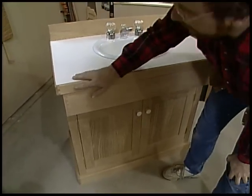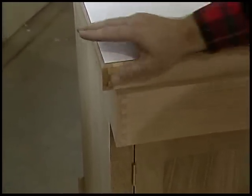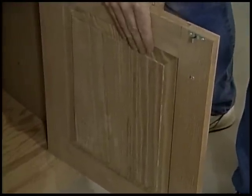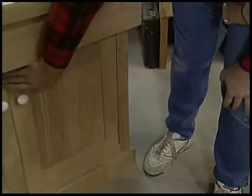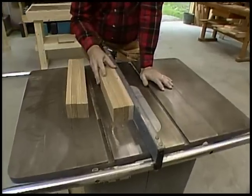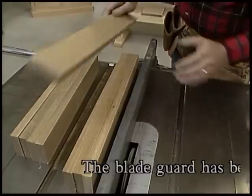For this cabinet, I've chosen to do all the joinery at the corners with dovetail joints — not only functional in strength, but they look good when finished, especially on this white oak. The doors are a flat panel on the outside, but on the inside you'll find a raised panel, something we see a lot in Shaker pieces. They wanted the full thickness of the wood for strength, so they tapered the panels to fit in the door frame. I'll start by making the doors. Here on my saw I have the stiles and rails for each door. I'm going to put a groove down the center of each piece into which the panel will fit, using the table saw with my adjustable dado head cutter, set so the groove is centered and about three-eighths of an inch deep.